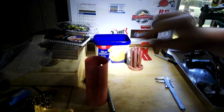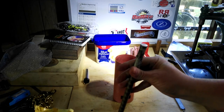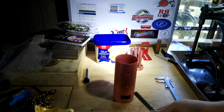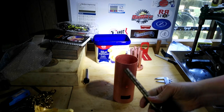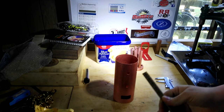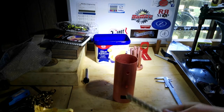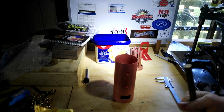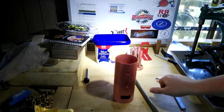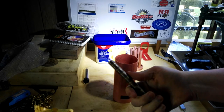Before we do that, I thought today I might make some bushes. I've got some phosphor bronze, 14 millimeter diameter. This is good because you don't get cavitation like you do with brass - the zinc seems to wash out of brass and you end up with problems later on in the life of the boiler that you can't actually see, which is a bit scary. So copper or phosphor bronze. I've got some copper but this phosphor bronze is not bad either.